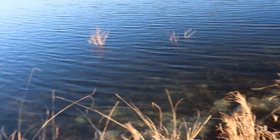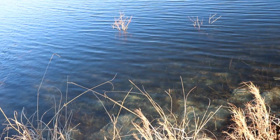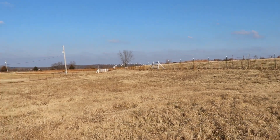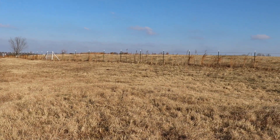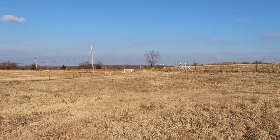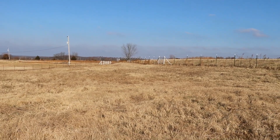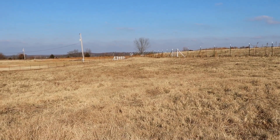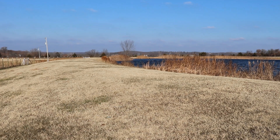We are thoroughly pleased with the sodium bentonite we put in here — I think it's done the trick. Here's a picture of the back side of the dam. The pond base is a broad base, so it was well built. We've got that one leak over there on one side, just around the corner. If we get that fixed, that's the only bad spot on the pond dam.